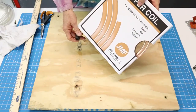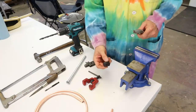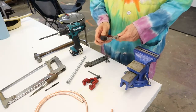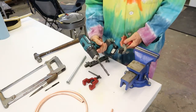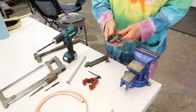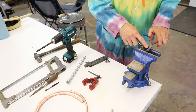To get air into the rocket through the stopper, we're going to drill a 3/8 inch hole right through the middle of it for a piece of 3/8 inch copper tubing. I'm going to hold it with a pair of pliers — a drill press would probably be better but I don't have one, so I'll use a cordless drill with a 3/8 inch drill bit. I'll open the vise to give me a little room to drill through it.